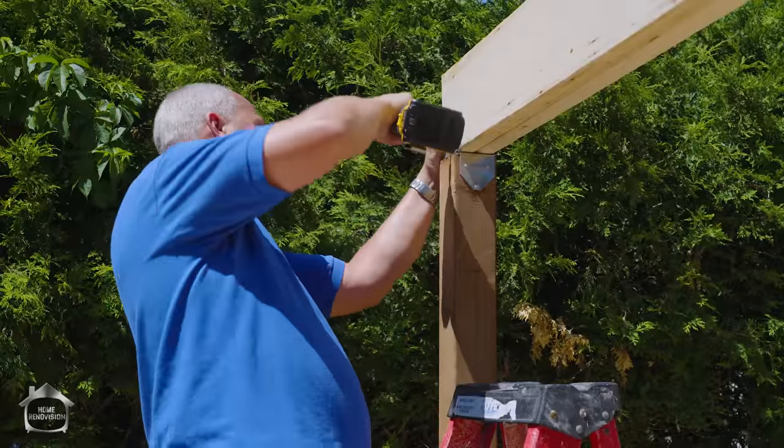I'm going to show you the hardware because once you've got a clip like this, you'll never go back. This is just another version of the hurricane bracket. It goes on a flat surface to the top of the surface like that, and then you screw through the side and into the cross member to tighten it all together. We're going to measure in and install these temporarily just to hold the structure together while we build everything.